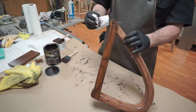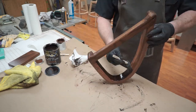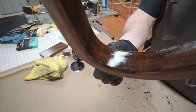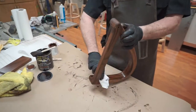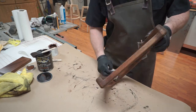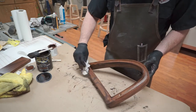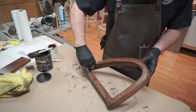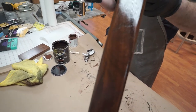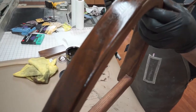When I did this on some test pieces, I was thinking about the fact that I used an oil-based paint and now I'm using a water-based stain. As most of you know from basic science, oil and water don't mix. And sure enough, I had a little outgassing, fish-eyeing, some bubbling. But I just wiped it down with a paper towel and it really didn't affect the wood too much — I was worried, especially heading into the final finish step, but it didn't affect it.